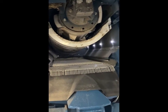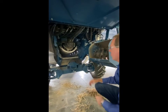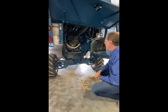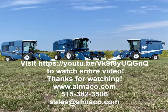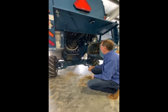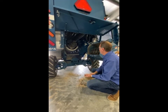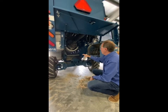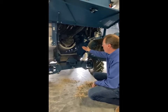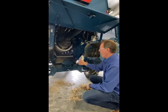It's a single sieve instead of a dual sieve, with the rotor powering material out through the drive. For green stem material, this is an excellent machine because the material isn't sitting on the sieve or wrapping around a straw puller — it's being powered out the back. The single sieve is quick release and pulls out, with adjustable short finger, long finger, and hole sizes from 4mm up to 32mm, fitting pretty much any crop. With the rotor and single sieve setup, we're getting about a 30% increase in throughput, which increases your efficiency for the number of plots you can do throughout the day.